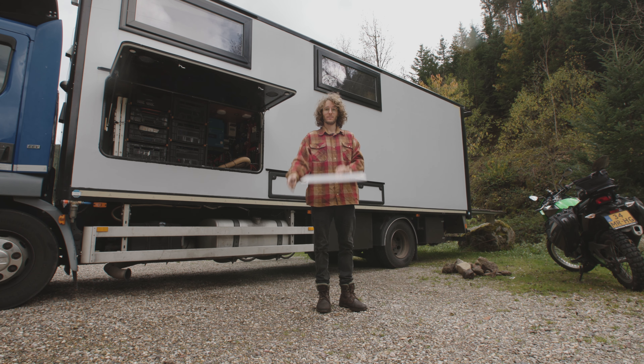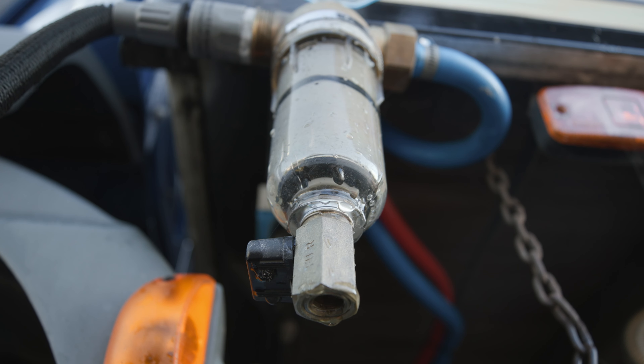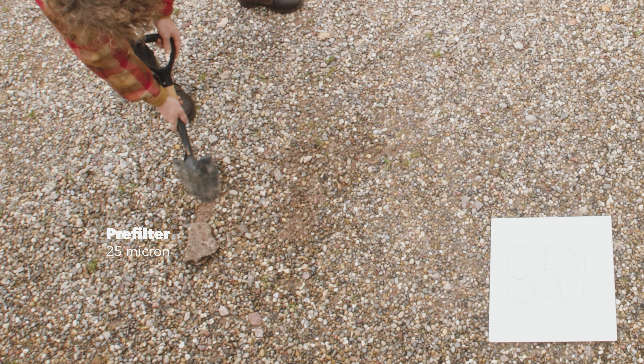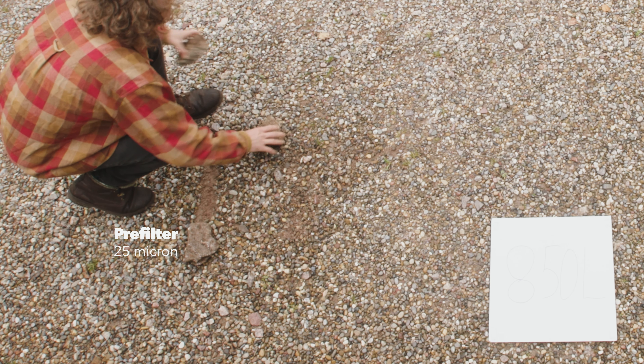Okay, so this here resembles our 850 liter water tank. How do we get water in there? We hook up our water at this pre-filter. What that does is it removes sediments like sand and small rocks, but maybe also harmful stuff like metal residue or whatnot. This particular product has a 100 micron mesh, but we bought one that is 25 micron, so a bit smaller. The nice thing about this pre-filter is that you can rinse it now and then to clean it, so you can reuse it.